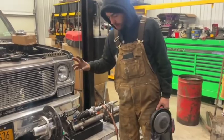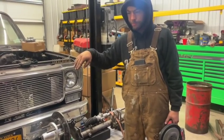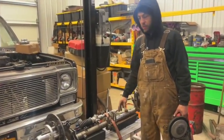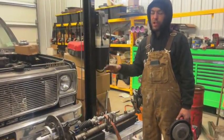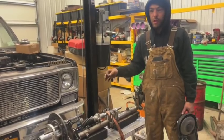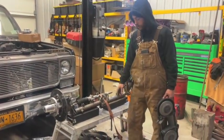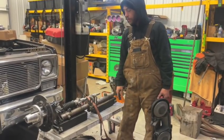I put a digital angle finder on the kingpins here. Kingpins is what sets basically everything on the car, the location of the kingpin. And then I mounted the rack directly to the axle, so then we could have full suspension travel, and the toe and stuff like that never changes. I built it with an adjustable slip shaft on the steering, so that the axle can move up and down without any binding or anything like that. And then the wishbone attaches down here, and this is our third shock bracket that I built.